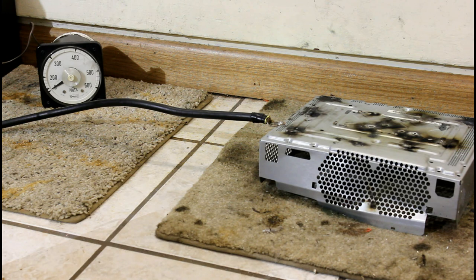Just a word of caution: if you do manage to get your hands on capacitors this big, do be careful. Capacitors resist changes in voltage by producing currents, and they have very low internal resistances, so the current comes out virtually without limits. Thousands of amps can happen very easily — it's explosive. I'll be wearing hearing and eye protection because I value my hearing and my sight. In real life you can actually feel the shockwave come off of the explosion.